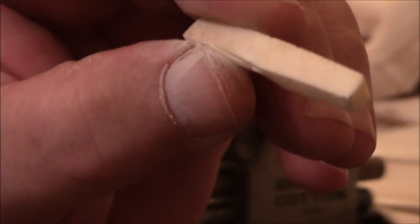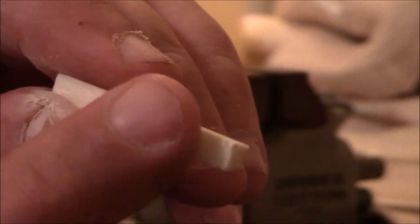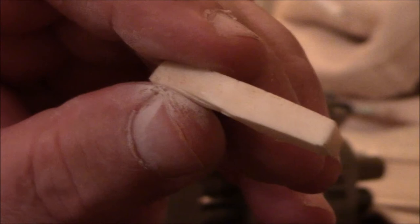Okay, guys. Now, the good part about this bad cut is that I left enough on the wrong side of the cut to where I can actually take a file and file this flat and straight. You follow me? A lot more work to be done, guys, by doing it this way. It's not going to be as easy as I thought it would be to get the Dremel done. But I'm below the line, so I still have plenty of room to file this back down to where it's flush and flat and will still work.